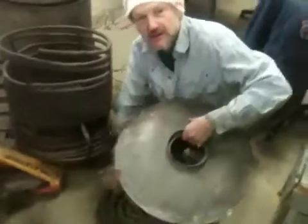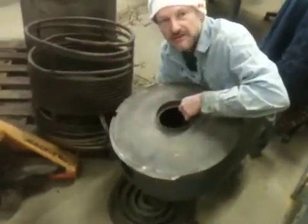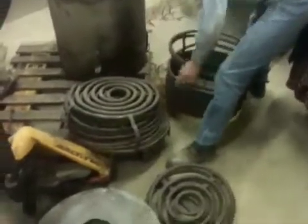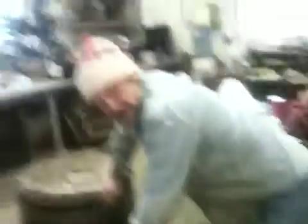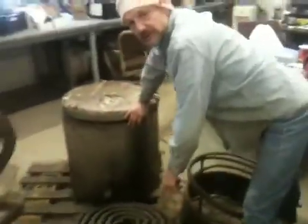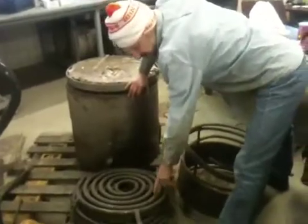This is sitting here with intensive heat touching these coils. It was so intense that we got a blowout of this coil, because the superheater was on top of it and was basically protecting it. But the flame was still so hot, and the boiler was so old, that it just expanded because of the internal pressures — because steam temperature and steam pressure are directly related.